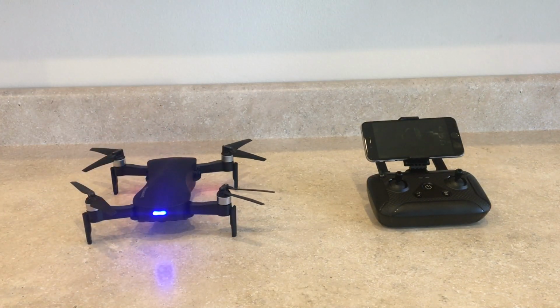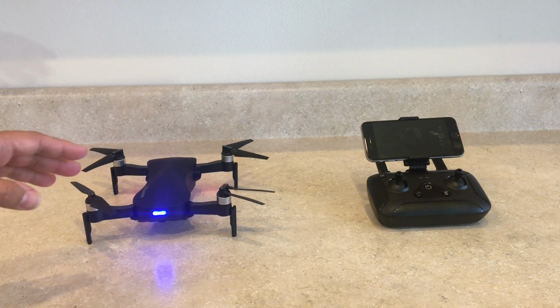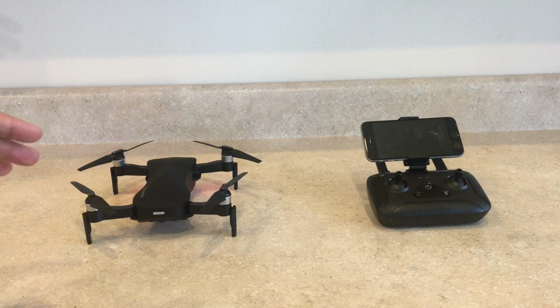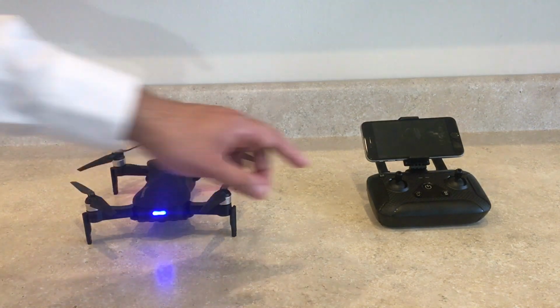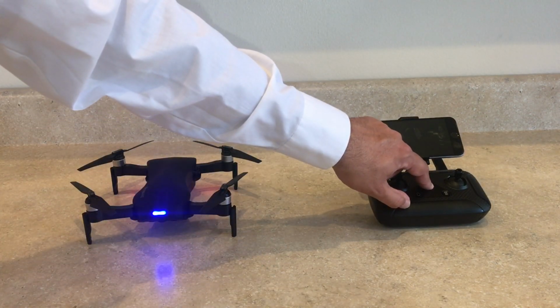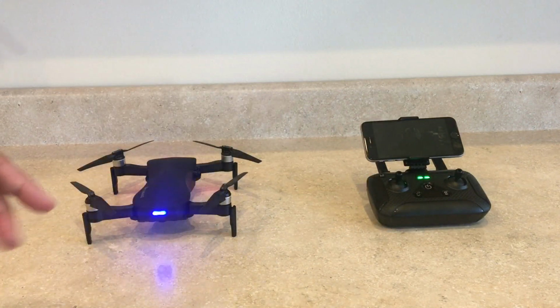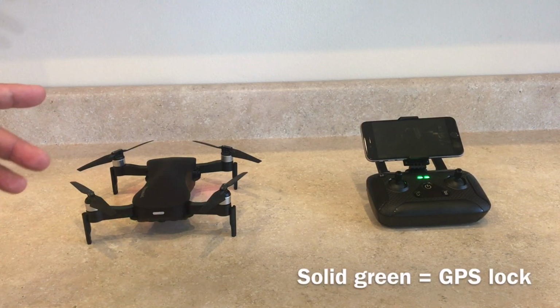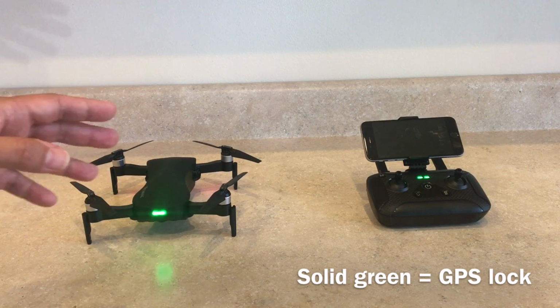And once that's done, the gimbal and gyros will initialize. So make sure the quadcopter's at flat ground level without moving. And then you'd want to activate the transmitter by pushing its on-off button in the center and keeping it pressed. And it should automatically bind out of the factory, so no need to move the throttle stick up and down. And so at this point, you would wait for the blue light to turn green so that the basic initializations, such as the gimbal and gyros, are set.